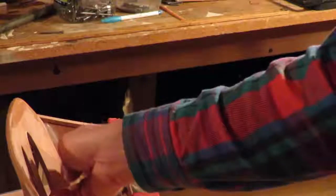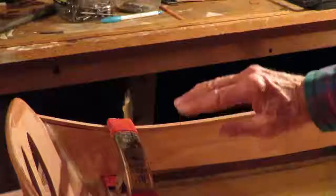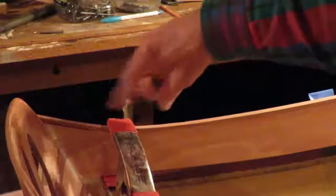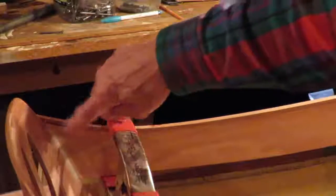So, it's a little hard to clamp right where it's slanted so much. So when I glue this on, I have a little excess at the front. I'm going to slide it back a little bit, making sure I have enough wood at the front. And then the most significant amount of the curve will be right where we want it, right in here. Okay, and you can see this first side looks really nice over here. That's just taped in place, no glue yet, but tonight we'll be gluing it in place.